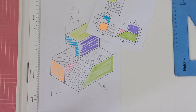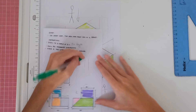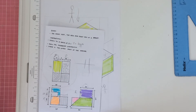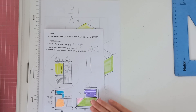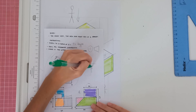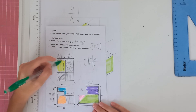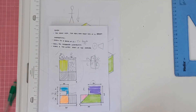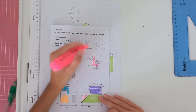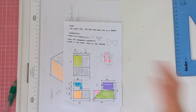I hope this helped you understand isometrics a little better. When we label — I have a separate video on this — with third orthographic projection we always have our top view, front view, right view, and left view, along with 45-degree projection lines. That's why we have top, front, and right — we've sectioned out those portions. Understanding your views will really help with your isometrics. I hope this helped you get a better understanding.